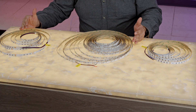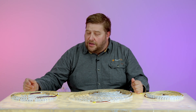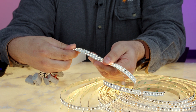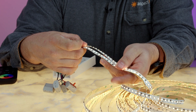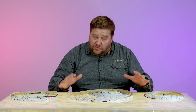This is really a time saver when you're doing a project because now you don't have to wire as many power supplies or controllers in — you can just daisy chain another one on. When we say you can daisy chain, the limit we always set is: compare the end of the strip light hooked up to the power supply to the other end. They should look the same. If one is dimmer, then you have voltage drop — that's bad. This product makes it so that the strip lights can be longer.